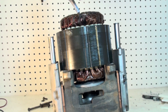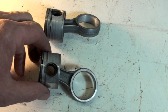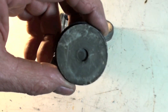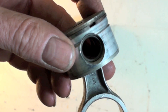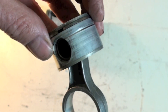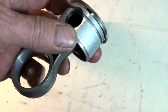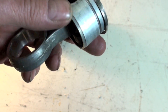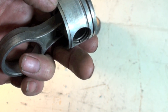Here are the pistons and connecting rods of the Carlisle. That's what the top of the piston looks like — one ring, one notch cut in there. You can see this actually has a fair amount of wear on it. This thing was in service for about 20 years, and actually it's a little more wear than I'd expect on it.